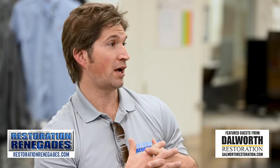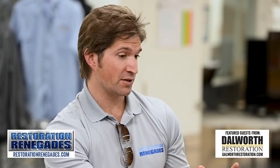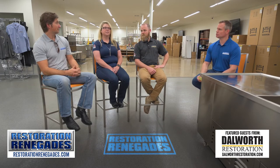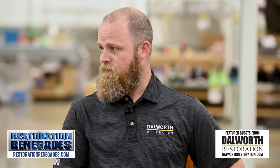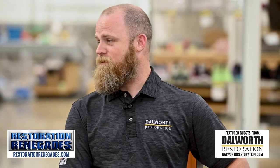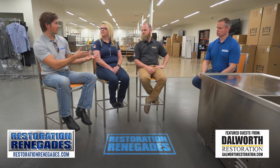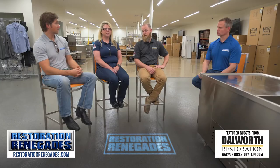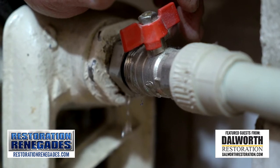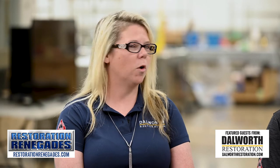I can speak from my own home hot water tank. It's in a really tight area in a closet. I think my wife could probably reach the bottom valve, but the top cutoff valve — I don't even think she could reach that. And even if she could, sometimes those valves go bad. If the water's hard and you've got calcium buildup, sometimes you can't even close them all the way, so it may not even be a solution for your wife to turn it off. So it's important to get the initial source of water cut off, but if you can't close the valve, water's still going to keep going into the tank — at that point you need to get a plumber out there, as well as a mitigation and restoration company to come out and mitigate any water that may be present.